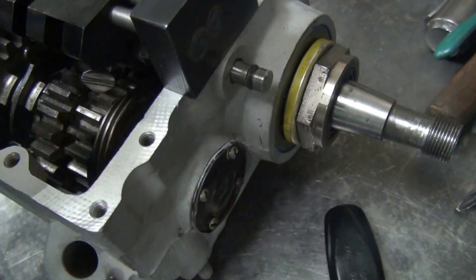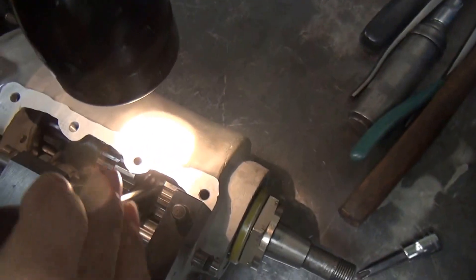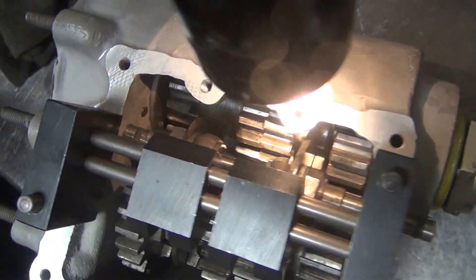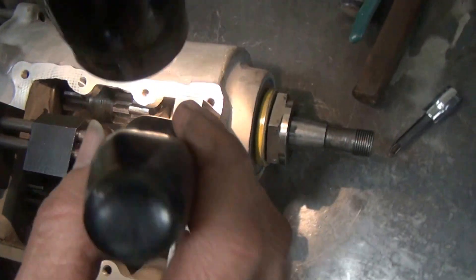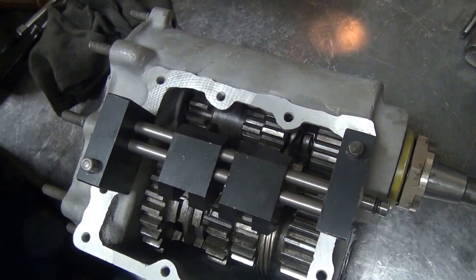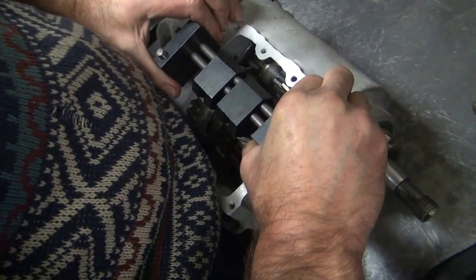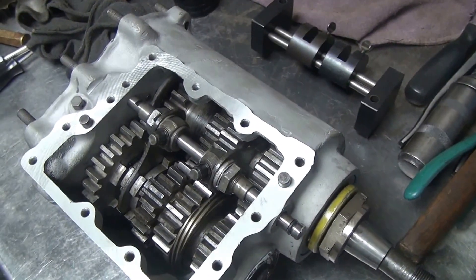We'll fix that lock tab while we're at it. Now the same thing happens on the other gear down inside where you can't even see it - it doesn't matter if you can see it or not, you've got to get it done. And I think obviously somebody was in here messing with this thing, because see the big gap in there? Over three-sixteenths of an inch in there. And over here, it's actually engaged in the gear and I haven't even moved it over yet - I'm all the way to the outside. That thing's off by an eighth of an inch. So my guess is somebody had this apart and never put it back together correctly.